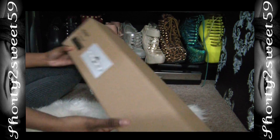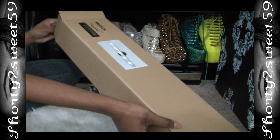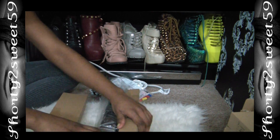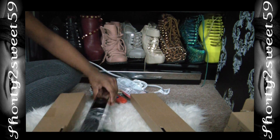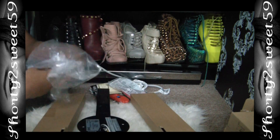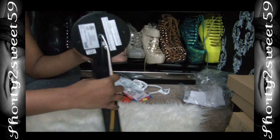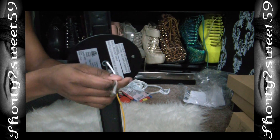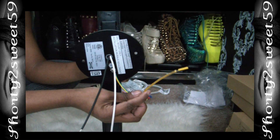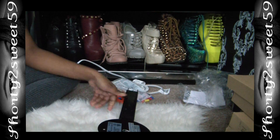First thing we're going to do is take the bar light out of the box — pretty simple. I know how to work with electricity from my dad; he taught us a lot of this stuff. In high school we even had to build our own circuit board. So this is the packaging — it comes in a basic plastic bag. This is what the bar looks like. At the back you have the cords we'll be connecting: a black one, a white one, and the ground wire. The black is positive, white is negative — do not mess with the ground wire.